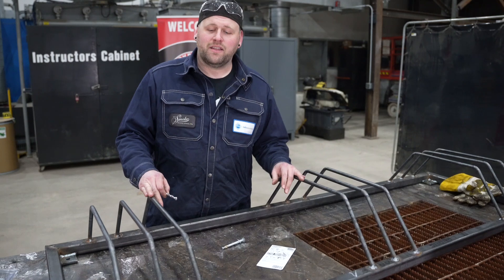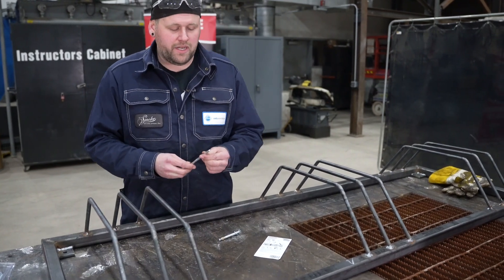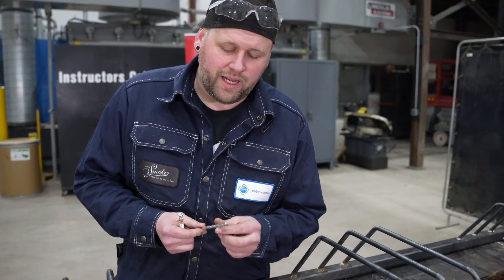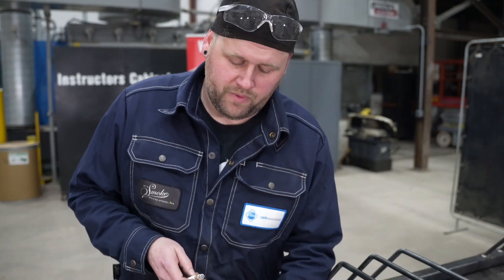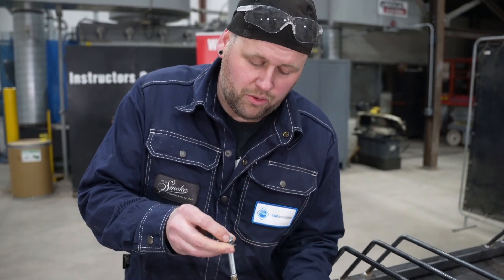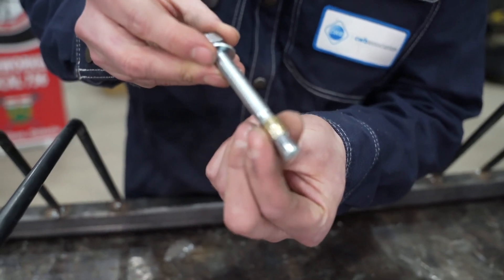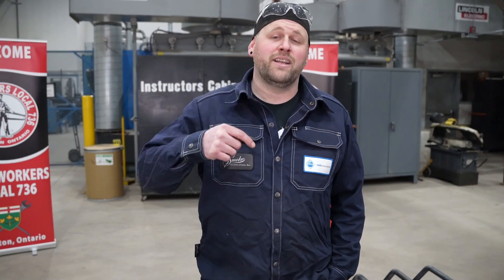Congratulations, you have a bike rack! You could choose to paint this or get it powder-coated. When it comes time to install, you're going to need a masonry bit, a hammer drill, and some wedge anchors. A masonry bit has a special carbide at the front that doesn't dull out when you're drilling concrete. A wedge anchor has a little collar at the bottom — you're going to hammer that into the hole you created in the concrete, and as you tighten, that collar is going to wedge itself inside the concrete, creating tension. Thank you very much for watching this video on how to build a bike rack. The prints for this will be available in the link down below. If you found this video informative, please like and follow for more.